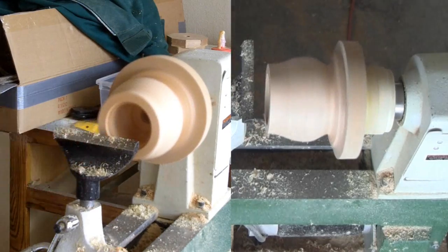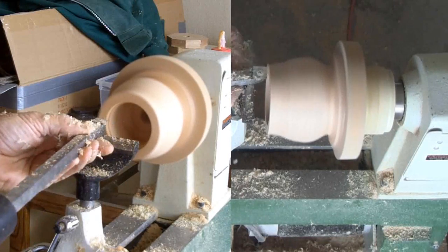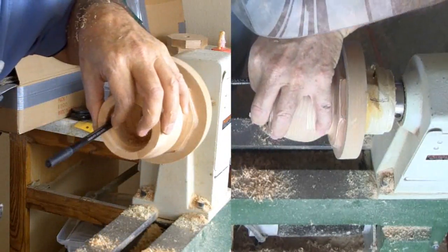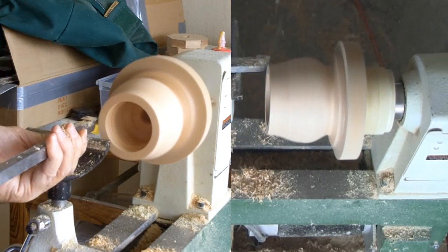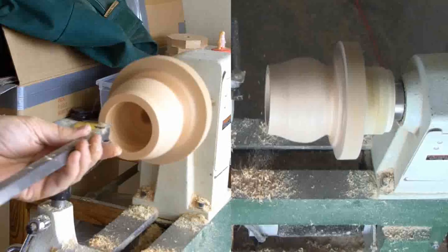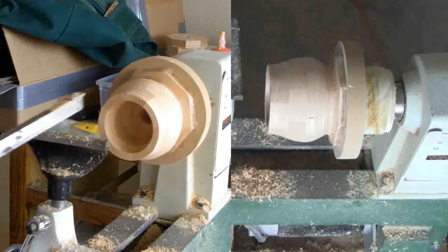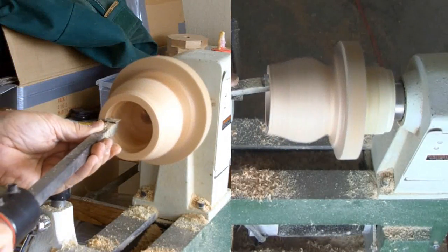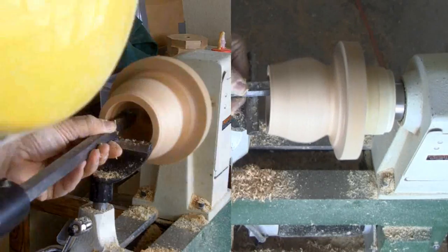Back to work cutting the mortise using a square carbide cutter. I'll stop and place a pen inside the mortise, then sight along the pen to the lathe bedways — I want the sides of the mortise parallel. The pen tends to magnify any discrepancy. I adjust my cutting angle and repeat until they are.